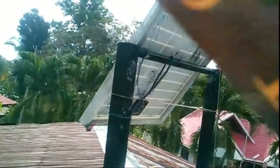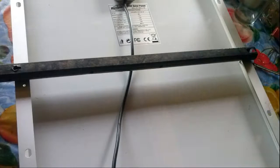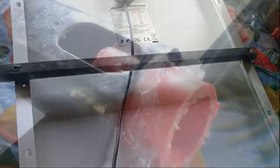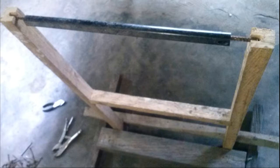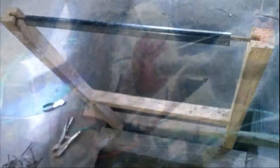Let's get started. First, I drilled two holes in the aluminum frame and mounted a metallic tube in it. This will serve as the axis. The tube is not completely cylindrical, so I inserted and glued a PVC pipe, and built a wooden framework for it to be mounted. After that, I assembled the homemade gear system from old VCD players.